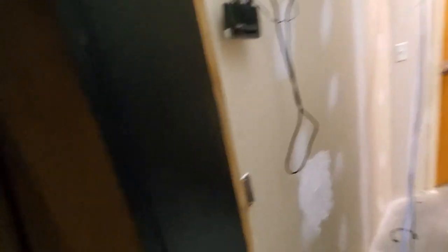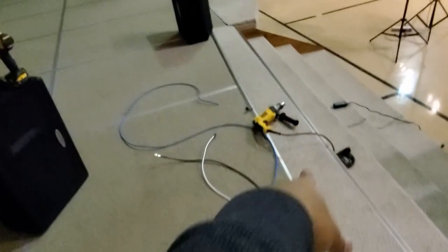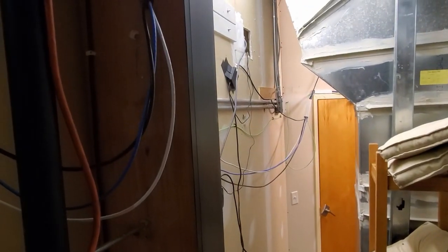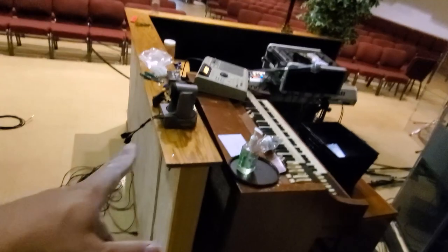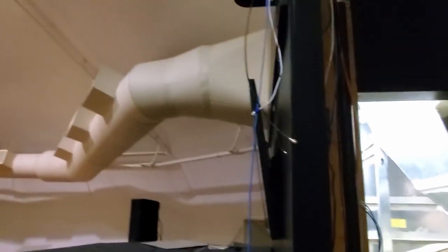Using the more powerful drill, I'll punch through here to fish all the extra cables up into that hole. We'll make it nice and neat — put slack up under there, tack it to the wall, and we've got the power brick on this side. Now we just need to hang the camera, set it to upside-down in the settings, make sure it gets an internet connection, and terminate the white cable for internet and blue cable for control.